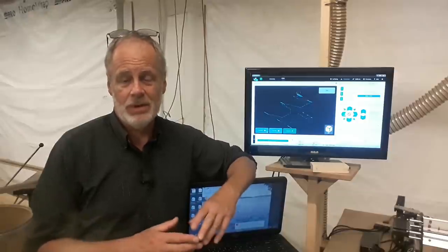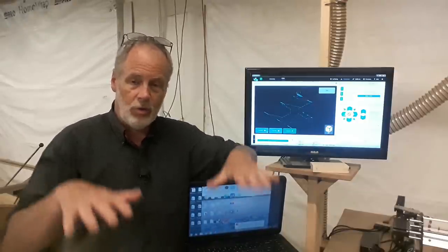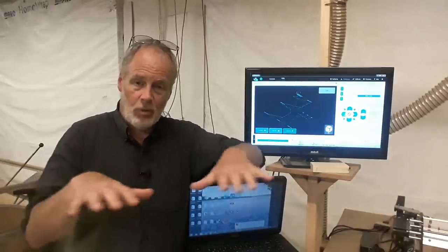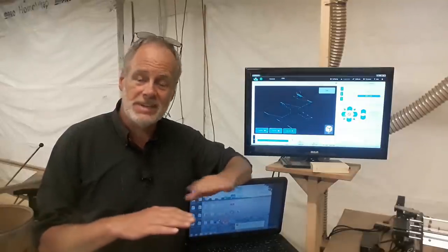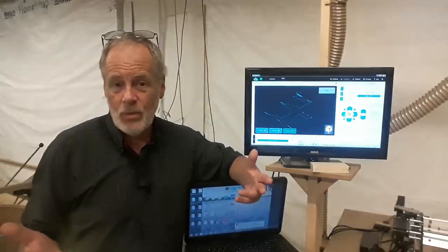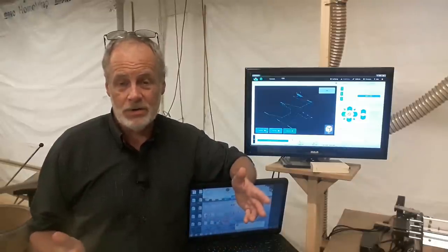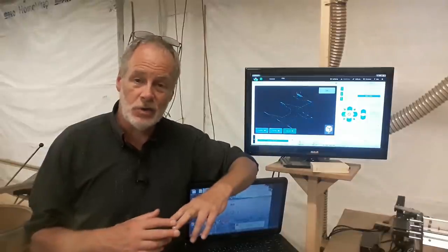For example, surfacing the spoil board. Spoil board is the board where you clamp your project down. When you put your router together, the majority of the tabletop spoil board is not parallel with the motion of the router. So you have to surface it to get it parallel with it. Up until now, we've had to design our own spoil board surfacing programs, and that's prone to errors. Well, Longmill added a feature to gSender where it will actually write it for you.